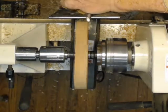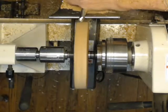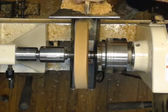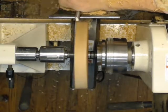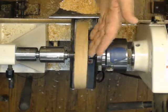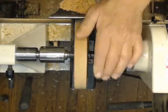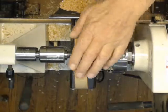You also need to check the wood. Does it have a void or gap in it? You'll see one at the front of the table that had a gap, and it wasn't checked until after it got turned or laid out. If you have a bad spot in it, can you lay it out so... This is going to be the back. Okay, this thing's got some massive cracks in this bad boy. That's all right. So this will still be a good layout. We'll switch over.